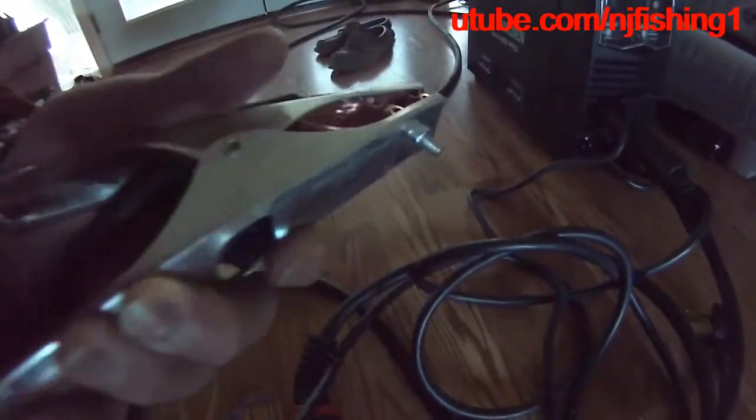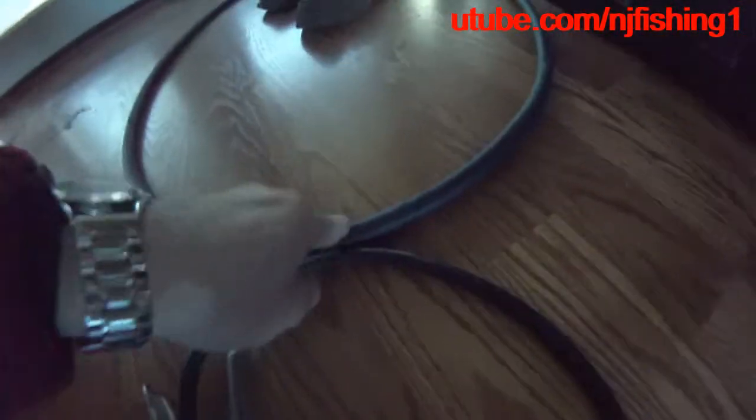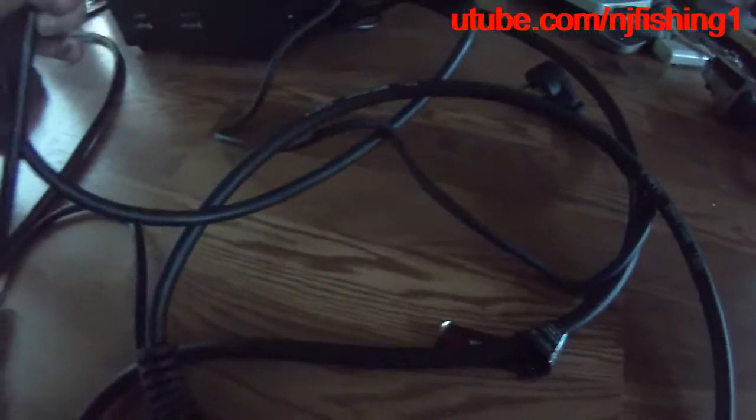The extension wire is not an issue, even though it's an 8-gauge wire. The next thing I want to troubleshoot is making sure this ground clamp is good. It's a brand new ground clamp — I don't see any fraying, any brokenness, anything wrong with it. This is a thick wire. I don't think it's as big as my 220-volt wire there. This ground clamp is probably 12-gauge, because it's about half the thickness of the 8-gauge. Remember, the bigger the gauge number, the thinner the wire.